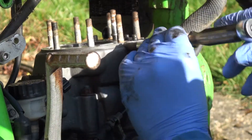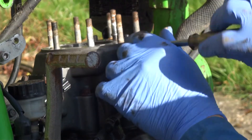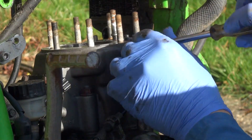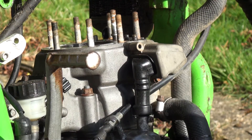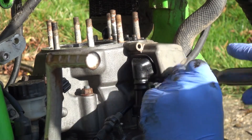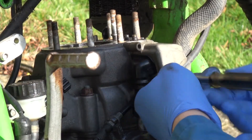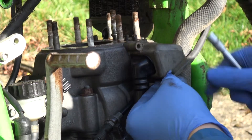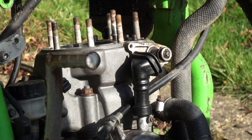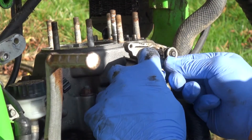Below this actuator arm there's a centrifugal mechanism — like an old-fashioned steam regulator system they put on old diesel engines and steam engines. Basically, the faster it goes it pushes out some bob weights and that turns this lever, this shaft, that you'll see in a minute. Now this is the centrifugal mechanism here and there's the activator of the power valve.